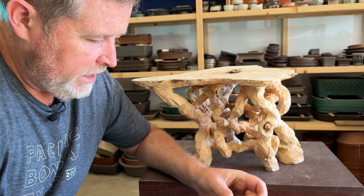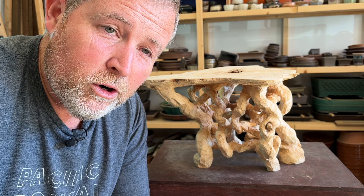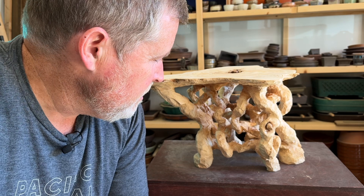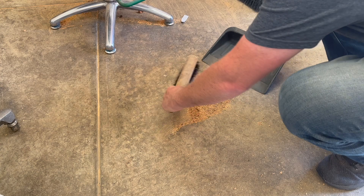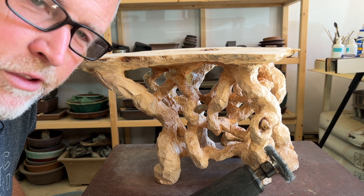From this point forward it gets quite laborious and involves more handwork. I don't think you need this many tools for a project like this — if you just had a die grinder with that large carbide bit you could probably do almost all of it with just that single tool. If you're looking to do a project like this, think about getting a die grinder and a couple of really high-quality bits, and that should get you most of the way.